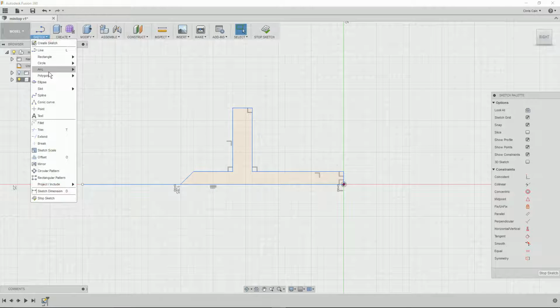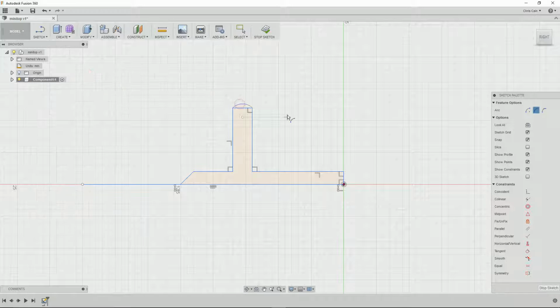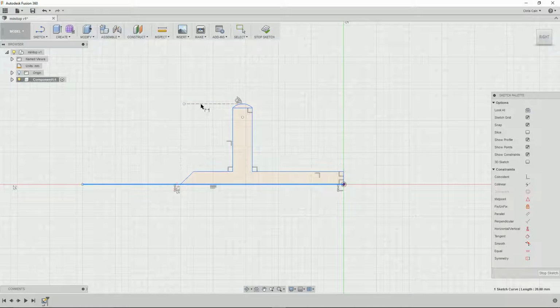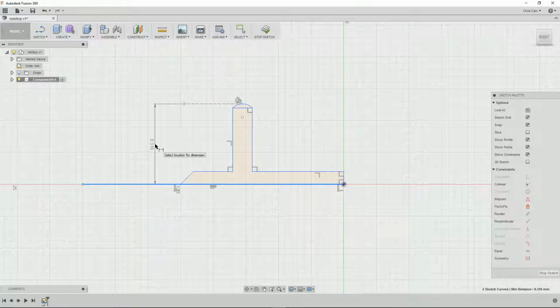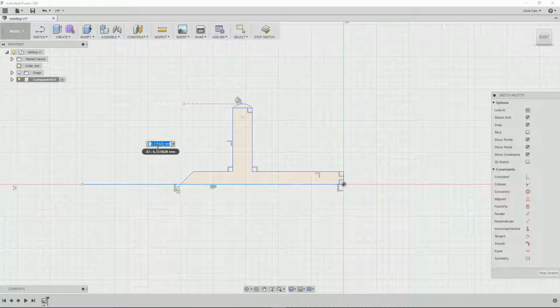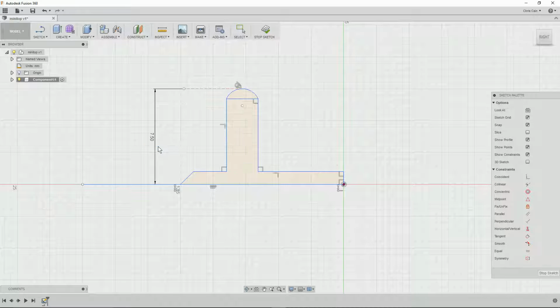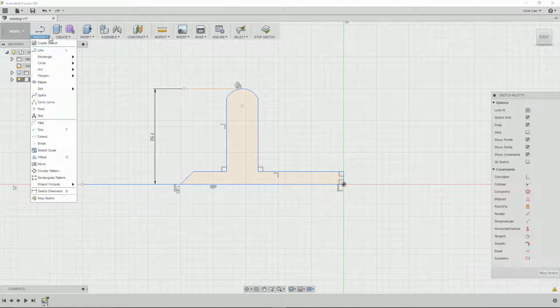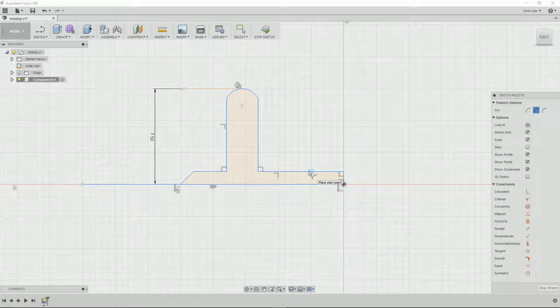Now we'll just add some decoration really to make it look a little bit nicer and give the lathe a little bit more to do. An arc on the end. Smooth out a couple of the other pieces. Just dimension it to show that it's going to be 15mm bar, so we want to be 7.5mm diameter, 7.5mm radius. Add some curves. Just to make the top look a bit nicer really, add a bit of bulk to it so it spins nicely.